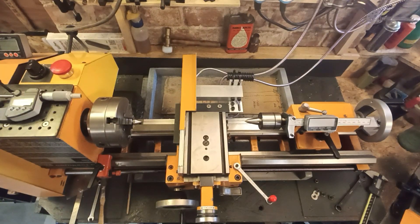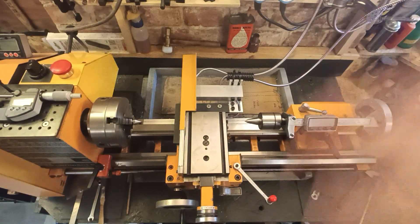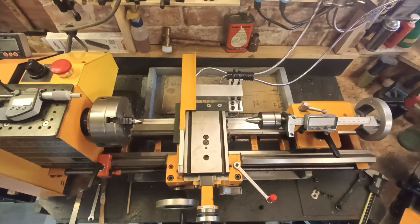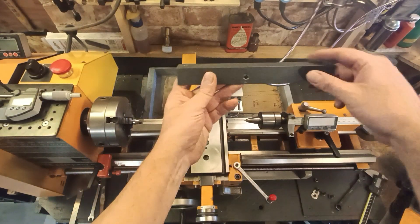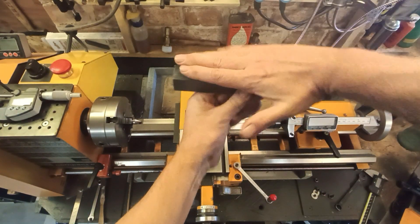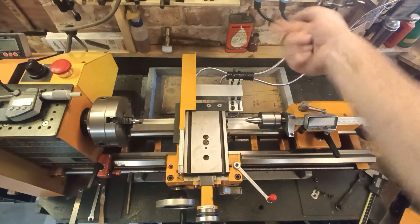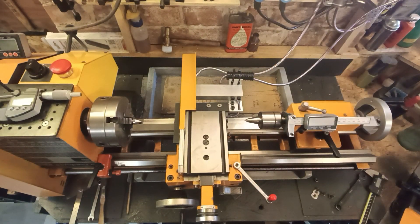I have a glass scale in the back. There are two mounting points for a drill head or a mill head that you can attach to the lathe, and these two mounting holes are M8. I installed an angle iron to these two points and laid the glass scale on it. It's lying here — you can see it in the back. It's not a perfect solution because the opening is now on the side and not underneath, so chips could fly in, but that hasn't happened yet.